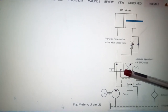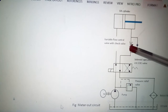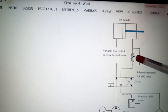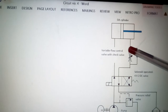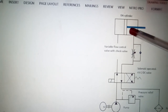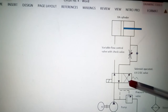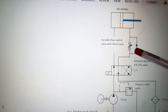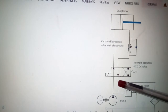In the second position of the directional control valve, the oil is taken by the pump and goes through the check valve — it does not go through the flow control valve. As you can see, the check valve will operate in this direction only; the liquid coming in this direction will lift it up so that flow can pass through. It then goes to the rod end of the cylinder and the piston gets retracted. The liquid from the other side flows back and goes to the tank through this filter.